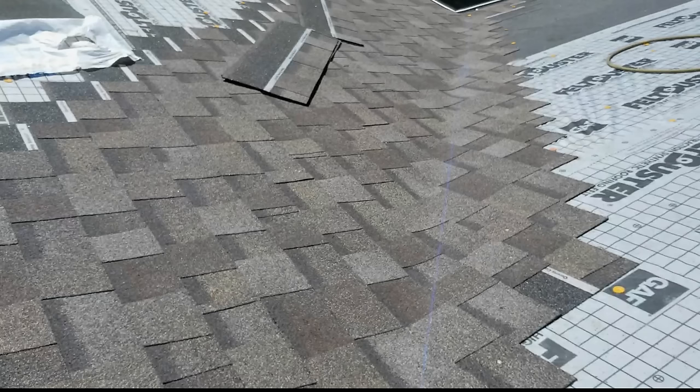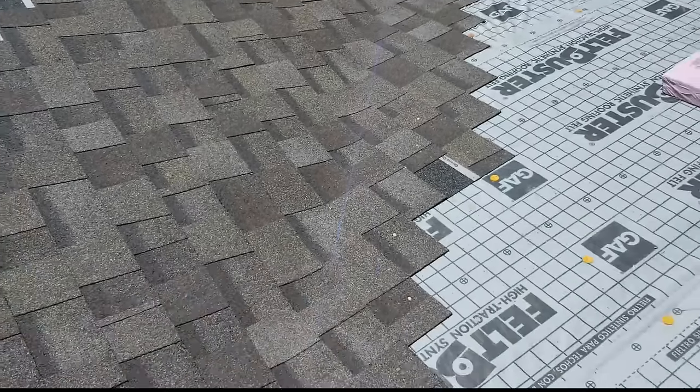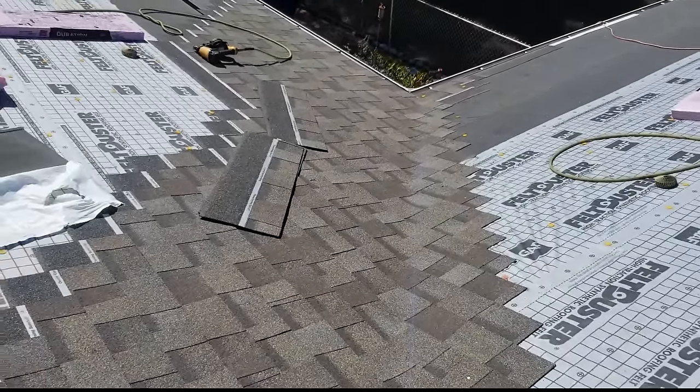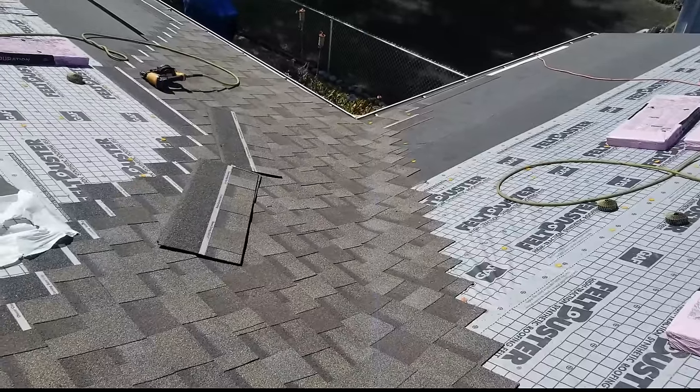Because if you remember, it was your nail on your end, skip over as usual, 1, 2, 3. And then you want to put those three nails a little closer to the center of the shingle. Then you do another nice big skip before you put your final nail. So it's 1, 3, 1 on that nailing pattern. Good go-to. Down at the bottom, he didn't do that though. I just kind of eyeballed it for what's going to look nice down this valley.